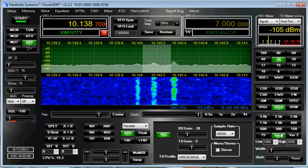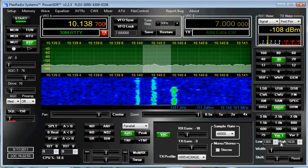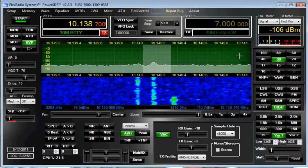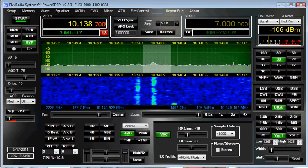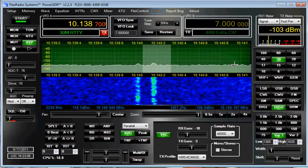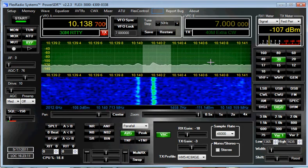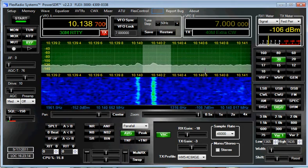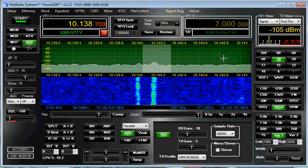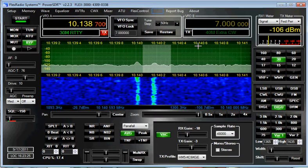So if I go back down to the filter I've described — the custom filter I've described for whisper — then the noise level drops, and some of the garbage that pumps up my AGC, which is not necessarily a good thing, goes away. So only the signals of interest affect my front end. None of this stuff that falls outside of the filter affects my front end. That's how I use my variable filter and the view mode that I use Power SDR in.